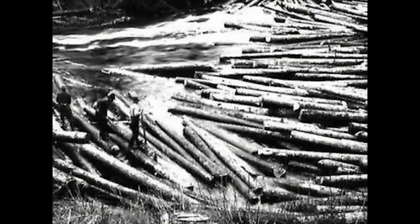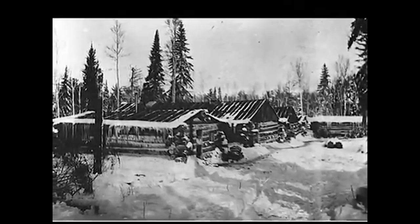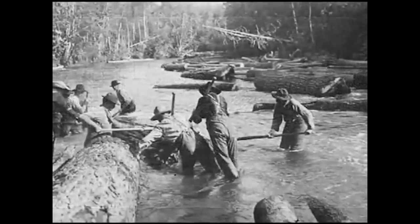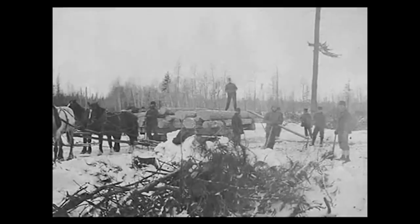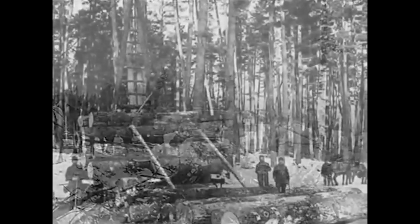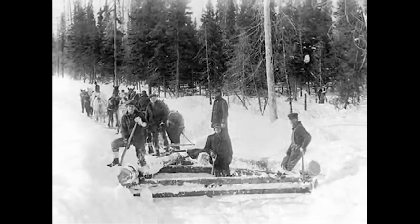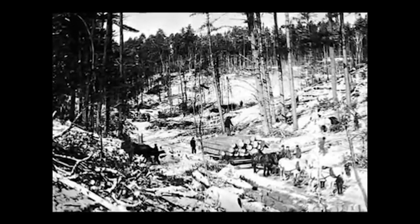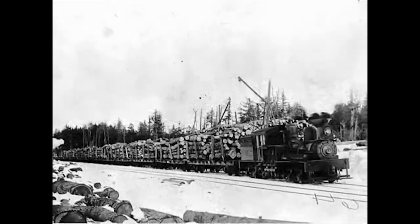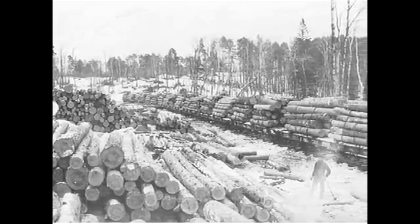They hold up great. And maybe that was one of the reasons — the pros with 30 degrees: it's good enough, it's fine. It's universal for all kinds of woods. You have no problem with hardwood, knots, etc., and it wears a long time so you're getting a lot out of your axe. It could have been a lot of reasons people thought that was the way to go. But I just strongly suspect now that you can do better and go farther, particularly with modern steels and the process that we're using today.